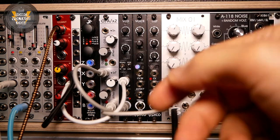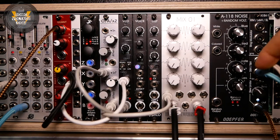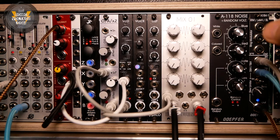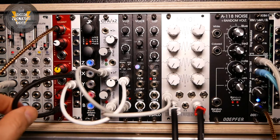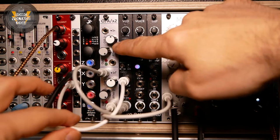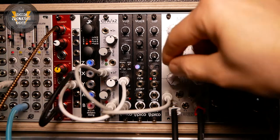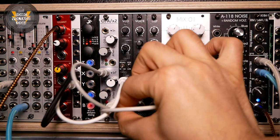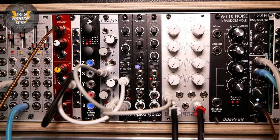So if you leave the jumper on, you can still do everything we've done before. Now I have just some LFO signal going into the Doepfer A-184-1, and I'm taking the output from here just to generate some voltage to go into the quantizer input. The quantized voltage, I send it to a mult, so I can have a copy to send to this VCO, and then we send it also to the other VCO anyway. So I have a quantized voltage going into the 1 volt per octave input of the Pico VCO. The output from this module goes into input channel 1 on the ALM010.